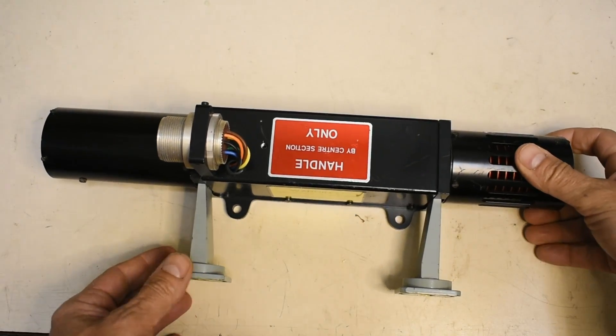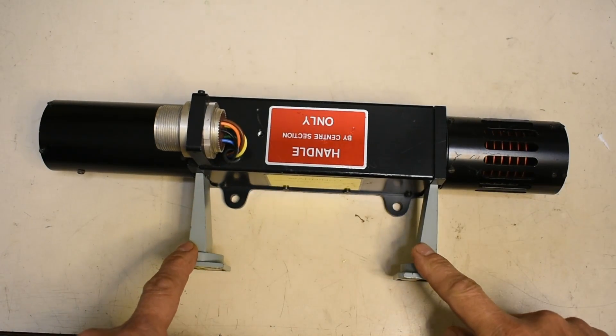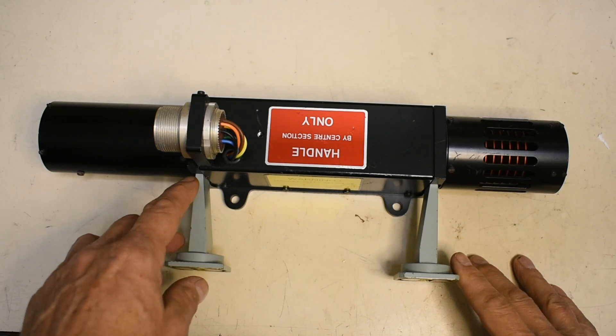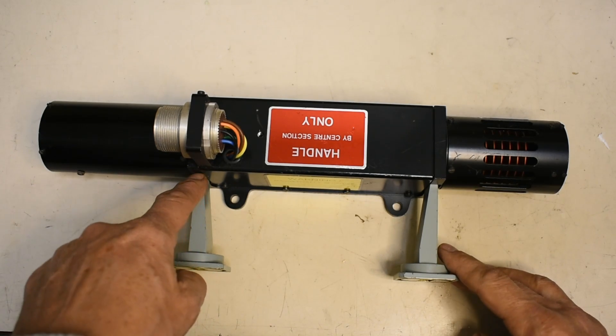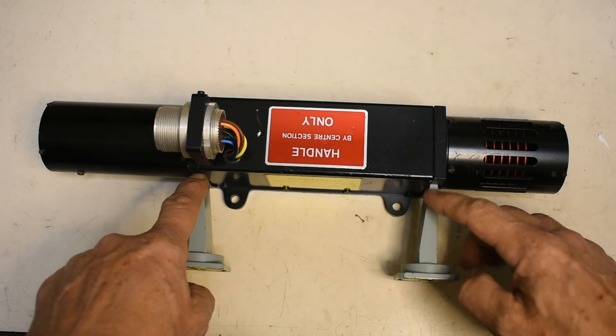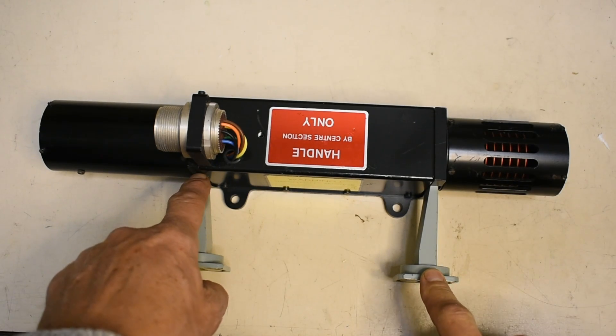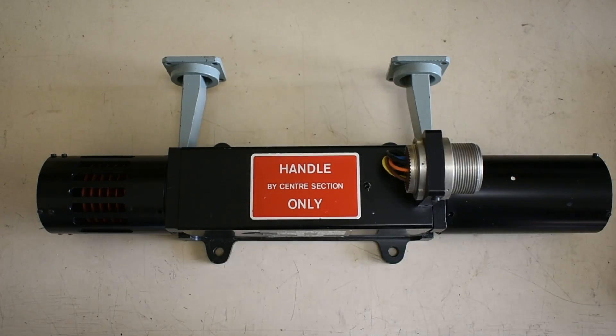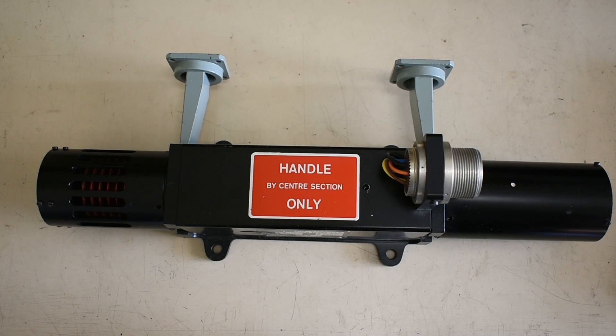We're going to have a look and see what's actually inside. These are the waveguides in and out. It doesn't create the actual wavelength — it takes in a weak signal and produces a larger signal, so it can actually be used as a transmitter or a receiver. As travelling wave tubes go, this is quite a small and low power device: only one watt output, with a midpoint of 9 GHz, and the anode is only running at 2.7 kV.